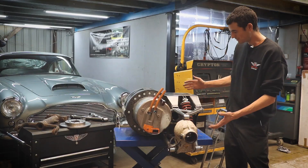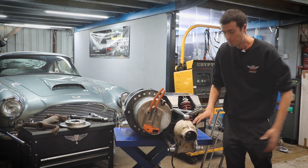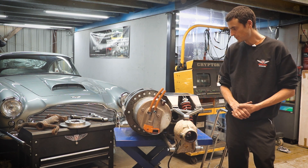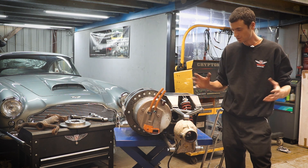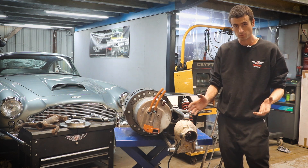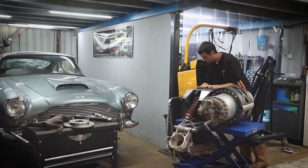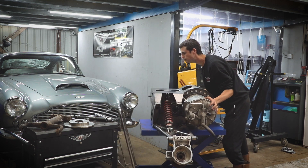This is the first iteration and can be used on a number of cars — it's more of a generic thing really. Now this upright is a Jaguar one, but of course a new upright would be cast and machined to suit. Further work from there is to actually get this to fit the E-type. The E-type Jag is quite a tight space under the chassis, so there isn't actually room for this upper wishbone. Anyone who knows about Jags will know that the upper wishbone is actually the drive shaft, so there's nothing up here.